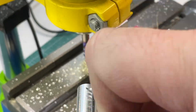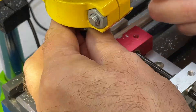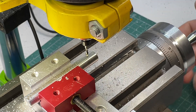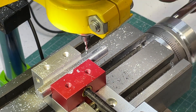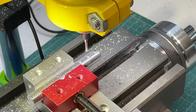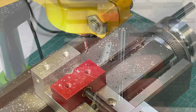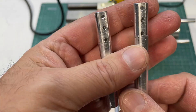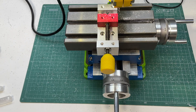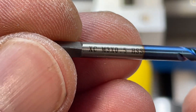However, for small and precise operations, such as processing small parts or parts that don't require high-speed milling, this method is quite justified. The advantage of the drilling stand is that it's compact, easy to adjust, and can be used for various tasks with minimal equipment costs. Still, it's important to keep in mind that this method has its limitations. For example, with heavy loads or tasks requiring high precision, a drilling stand might not perform as effectively as a milling machine. However, for my projects where simplicity and moderate accuracy are required, this approach works quite well.